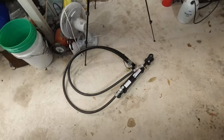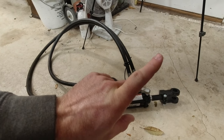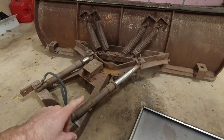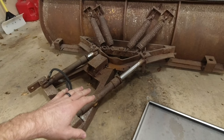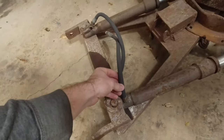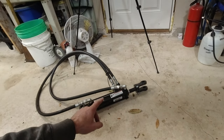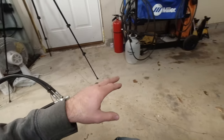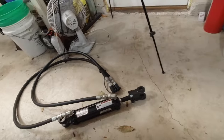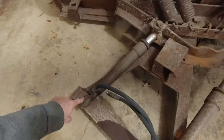I have this hydraulic cylinder that I bought for my John Deere number five sickle mower — the video for putting that on will be up here in the corner. We're going to use this cylinder to control the angle of the plow, because the existing cylinders are rusty and the old hoses are starting to crack. Since the cylinder is used on the sickle mower in summer and this plow is used in winter, I can just switch it back and forth — it has quick couplers so it'll work perfectly.